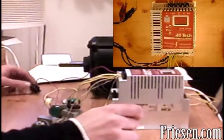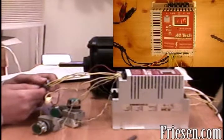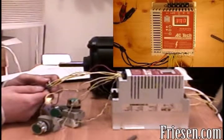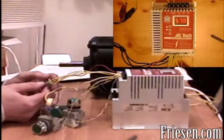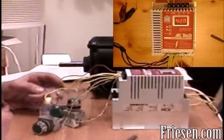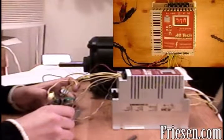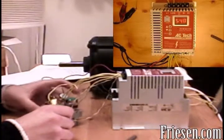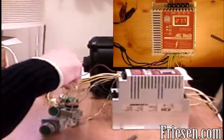Now the drive is configured and we can turn it on. We'll be able to control the speed with the resistor. I've got it set for full speed right now. The acceleration time can be adjusted through another parameter value — all of this is explained in the manual, or we may do a further tutorial on it. If I want to bring the drive up to 60 Hz automatically, I can press my first button. It'll spin up to 60 and hold there as long as I'm holding the button down. This could be used to jog a conveyor belt to make it speed up if there's nothing on the line. The drive will return back to the speed last set with the variable resistor.